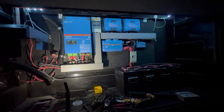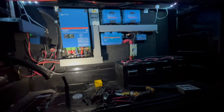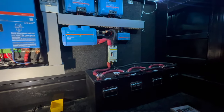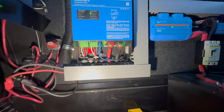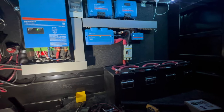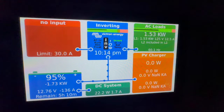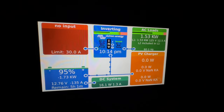Day has turned to night. I had an event — beer league playoff hockey, and we won. I'm working on the covering for these batteries and how we're going to secure them down. Before doing that, I wanted to do a heat soak test. I'm going to run a high load on this for a while using our FLIR camera to see what heats up and what doesn't. A little space heater running on high — we're going to be pulling about 136 amps, which is pretty close to an air conditioner. We'll run that for a bit while I put together the battery encasement.